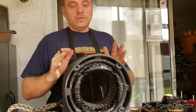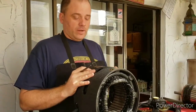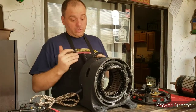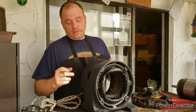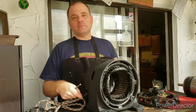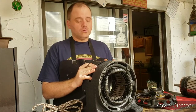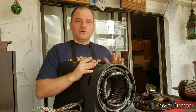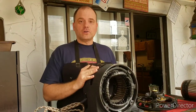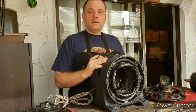What had happened was I plugged the motor in, the thing was humming, and I couldn't figure out what was wrong. So I did some research and went through a little bit of trial and error. What I discovered was that the windings themselves have a kind of polarity. At some point earlier, this motor had been rewound, and when they rewound it, they didn't have the wires sticking out like they would have been from the factory — they were sticking out in the wrong order. So when I twisted the top two together and the bottom two together to put the windings parallel, which is what you would do to run it on 110 — you would put the windings in series to run it on 220 — the windings were out of polarity with each other, and that was causing the motor to just sit there and hum. Once I figured that out, I changed the polarity on the windings and the motor took off and was running real solidly. Now off camera, I'll go ahead and put these pieces together and bring out the other motors, and you'll be able to see this one running as well as a few of the others.